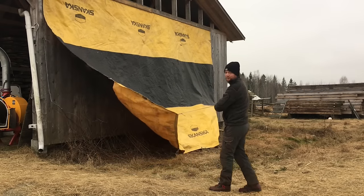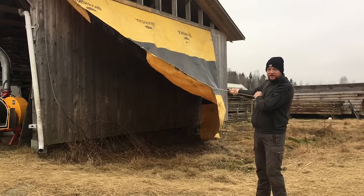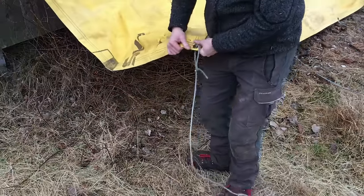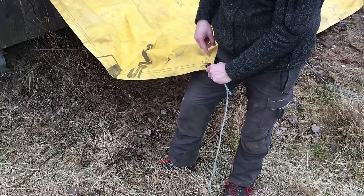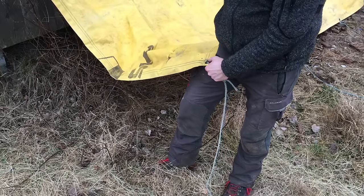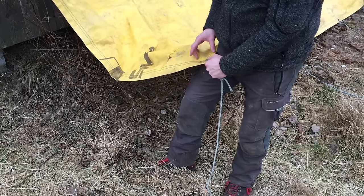And now I'm gonna show you my plan of how I'm gonna get tension on here and get it to stand here firmly. I'm gonna cut myself some pieces of wood and then I'm gonna put a 10 millimeter thick piece of metal in there on top that fits through these, but this alone will tear out when I put tension on it. So I'm going to put boards on here, 25 by 95 millimeters, so 1 by 4, on both sides and screw them together and get the tarp stuck between there and then put the metal in between there. I'm gonna do a 2.5 meter high.